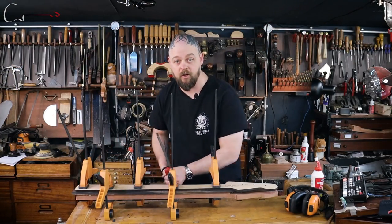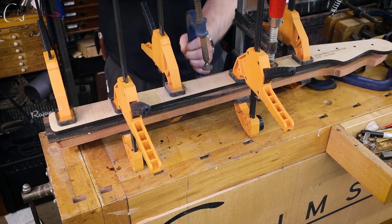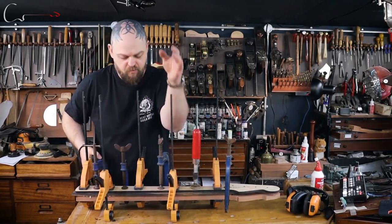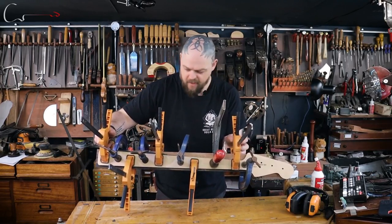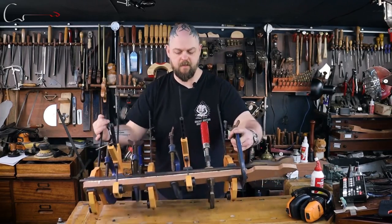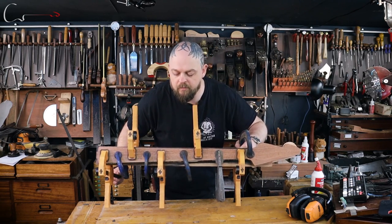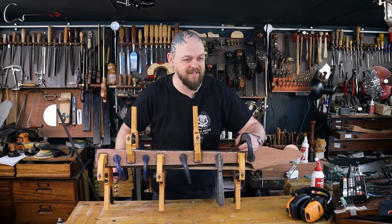Now after this, we're going to crack on with a body. All right, on with the G-clamps, just because. Okay, so there we go, that's done. Just check that we're all good, and then visually inspect and see how much squeeze out. You don't want huge amounts, but you do want to see glue pretty much everywhere, and no gaps, or at the very least, minimal gaps.